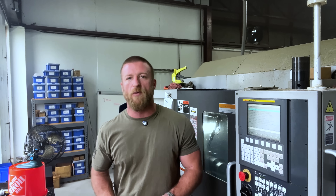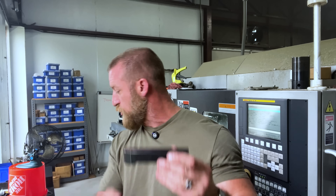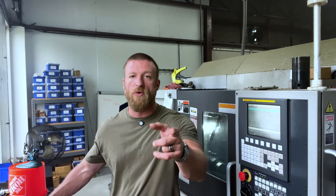I like WNMG as everyone probably knows, but CNMG is a more robust tool. In addition to just the tool itself — heavy rough with this, don't heavy rough with this — once we have our selection for heavy roughing, now consider your nose radius. You would not want to use an eight-thousandths nose radius to rough turn. The bigger the nose radius, the more damage it can take, the heavier cut and heavier feed rate it can take. So if you're doing heavy roughing, use the biggest nose radius you can for your spindle load allowable and for what your print needs.